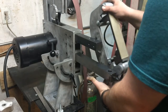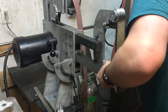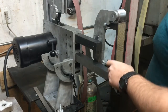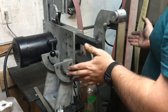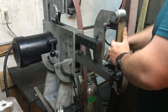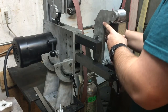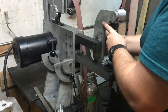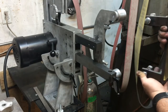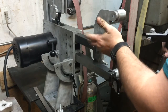So as you can see, we still have the ability to pivot and adjust full range, 60 degrees in each direction. Get a rough zero there. And we do have our tool arm installed, and there's no clearance issues any longer. Now to remove it, just loosen these up. The knobs are simply on the other side, which is probably better because now all your adjustment knobs are on the same side, so it's less to have to think about, I guess. But this comes right out just the same. Everything comes off as a unit. Nothing left behind to vibrate or rattle loose.